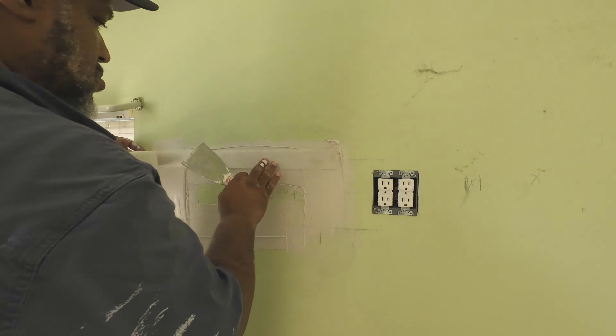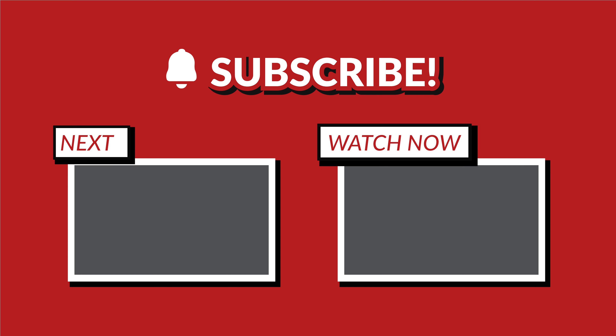You do have to put primer on it — some kind of primer. I use Sherwin-Williams — I like their primer block or pro block. I'll put it on the screen so you know what I'm talking about — it's my favorite primer right now. I use the light sideways so you can see any imperfection. I want every single imperfection gone, so it doesn't matter what light you see it in — it's going to look perfect.